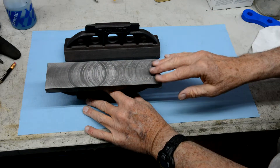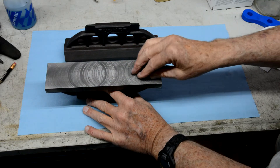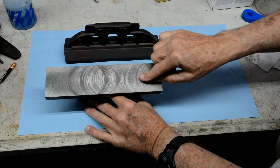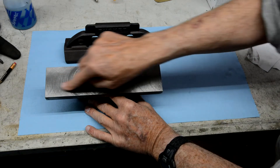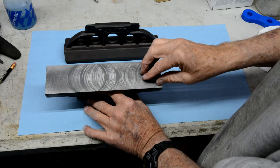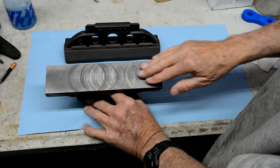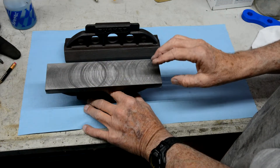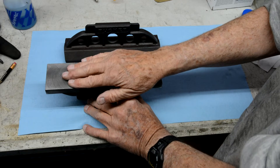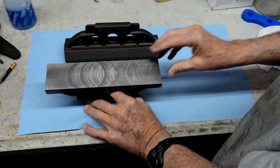it's an insert cutter — on regular steel it leaves an almost mirror finish, but on this cast iron it's nothing like that. Although this is plus or minus less than a thousandth; these grooves you can barely feel. It's just the porosity of this casting — this isn't ductile iron, so it doesn't machine quite as smooth as some other cast irons. But it's more than serviceable enough. I don't have a surface grinder, so I'm going to have to scrape this, go straight from machining to scraping, and I want to get it as square as I can.